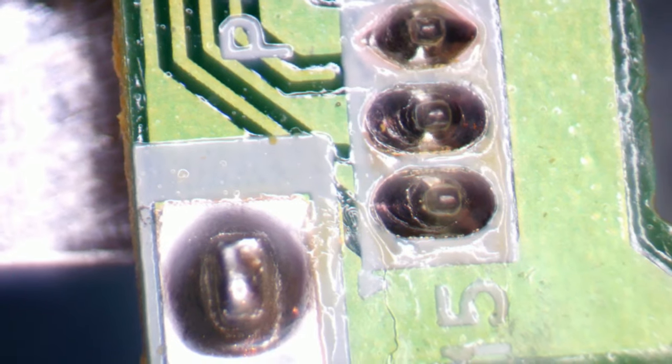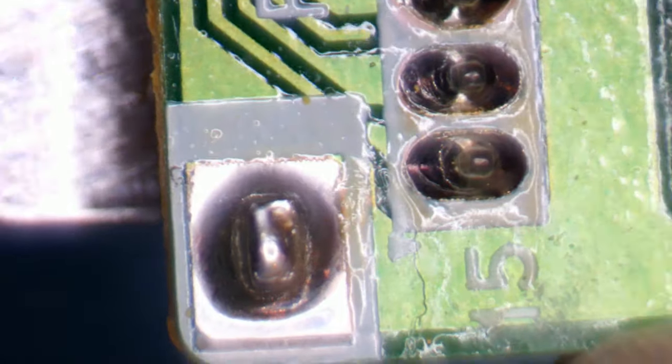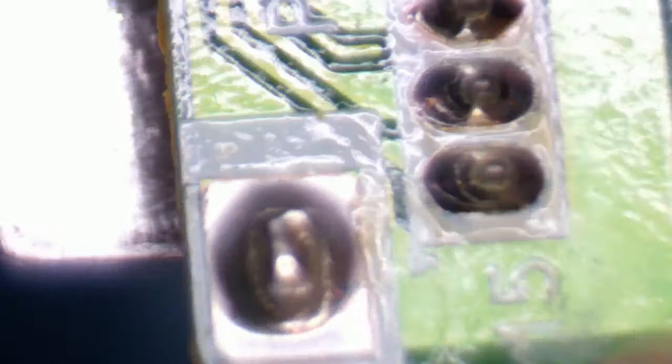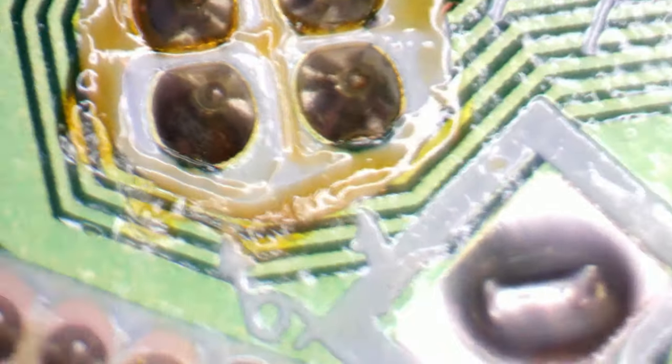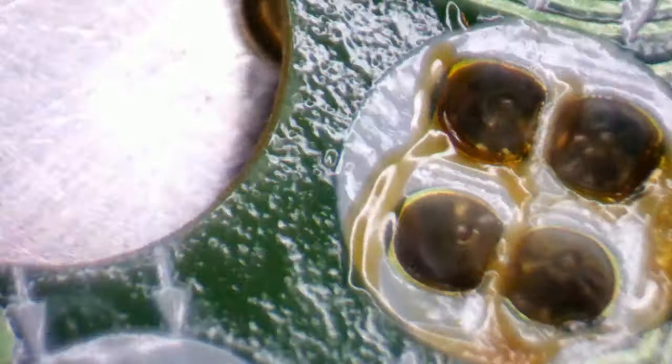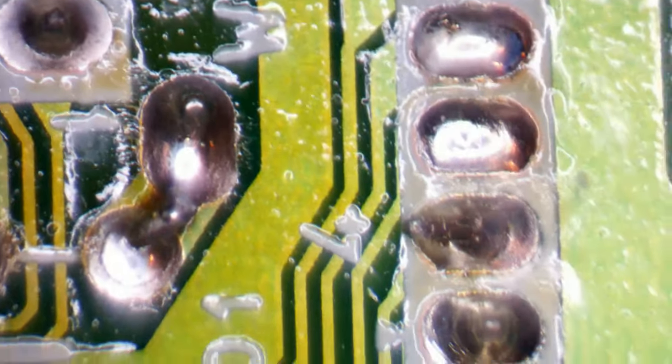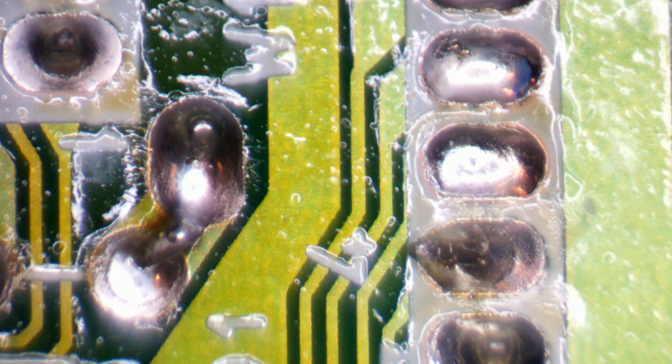There's definitely some dry joints there, as you can see. Bad enough? Maybe. I will take this screening can off and have a look under there too. These here are the contacts for the transformer and they don't look too bad, though there's one that could use a little re-soldering. I'll go ahead and re-solder everything I don't like the look of, and then we'll clean the heads and see what else there is.